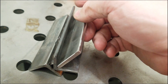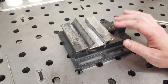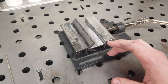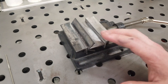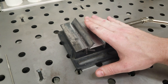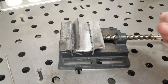Unfortunately the cord to my welder is too short to reach my bench vise, so I grabbed the drill press vise, mounted everything up, put some tension on it and we're good to go. My only complaint with my Everlast 160 STH is that the cord that goes through the wall outlet is pretty short — otherwise a perfect machine. I'm going to run a couple small beads along the top, let it cool so we're not warping anything, then flip it over and run some beads on the back side.